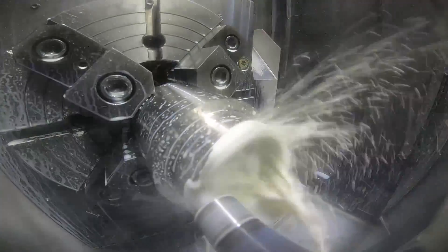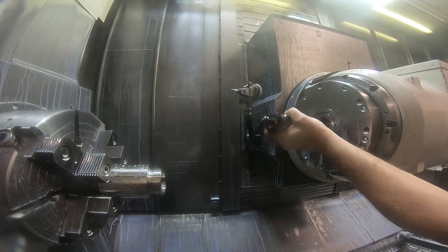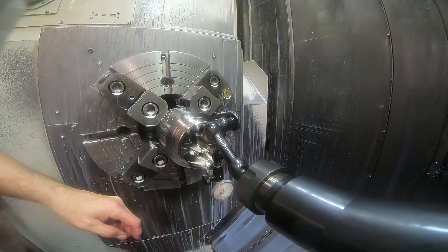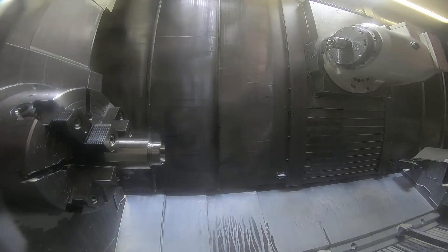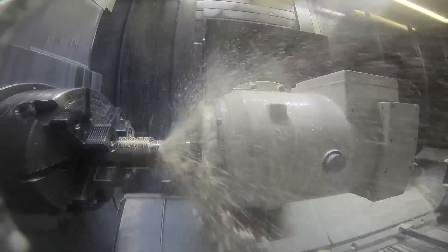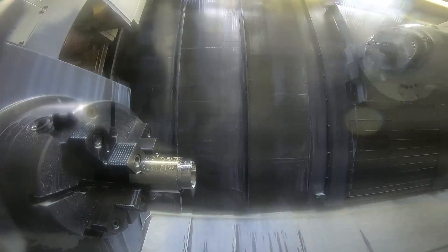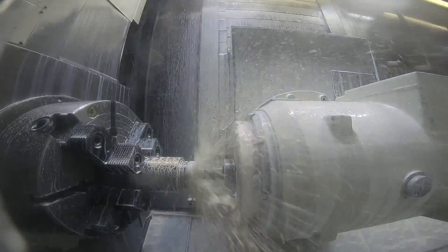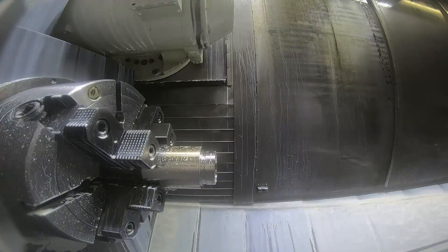So this tool is a quarter inch end mill and it's forming those little shallow recesses in the face of the counterbore there. And here I'm going to check the run-out, just to be sure that I'm on centerline. Because the two form tools that go into those holes that I rough milled — this would be that half inch one, it's kind of like a half inch reamer form tool — have to be on close concentricity to the part. So I'm just double-checking the run-out with the dial indicator. That tool just forms some notches on the sides of that half inch reamed hole.